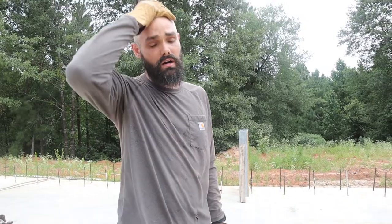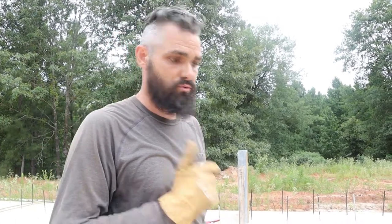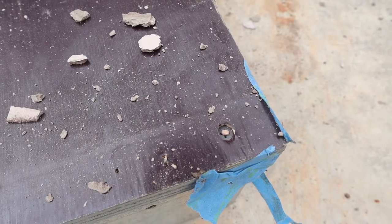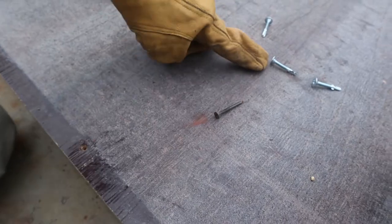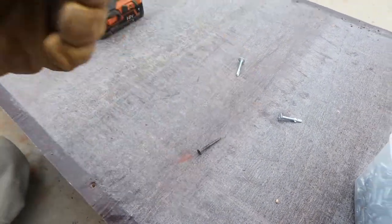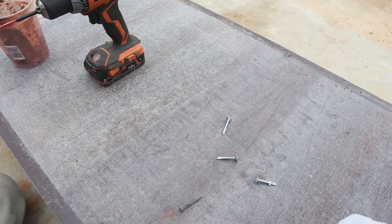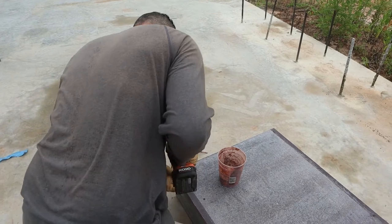Check it out. We are taking off some of the hardware from the original frame builds because it was just the wrong hardware. Bit too far into our MDO, and the screws are breaking. These are actually designed to go from plywood into metal, so they've got these nifty little locking mechanisms right there that will catch the metal, and the big wide heads that don't sink in quite as far. Yeah. So I'm just taking these and...